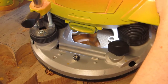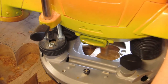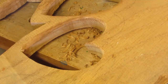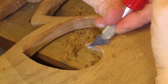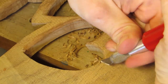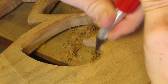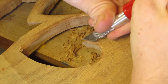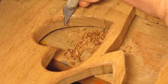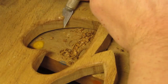In order to make the inner edges of the piece more pleasing to hand and eye, I considered a round over bit, but that would have left me with corners to refine by hand. Instead, I used cheap carving knives or hobby knives to round over the edges. I like how this turned out for several reasons — it gave the piece a hand-carved look, because it kinda was.